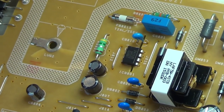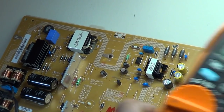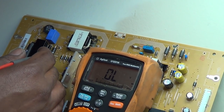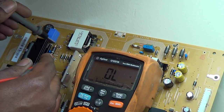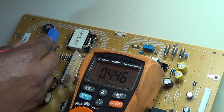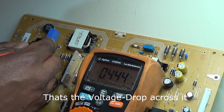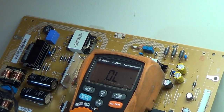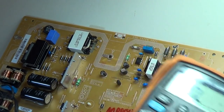A diode should read — here's one over here on this side — this is how it should read. Reverse the leads and you should get 0.5 or 0.4 volts — that's the forward voltage to turn it on, about 0.4 to 0.7 volts. The other side should read close to infinite. Sometimes when you test diodes you'll see the capacitance charging up in the circuit with it, but just leave your meter on there and it should read okay and not shorted — that's the main thing.